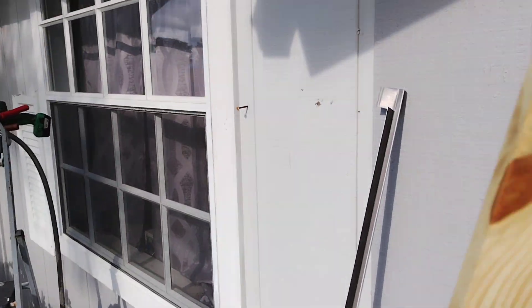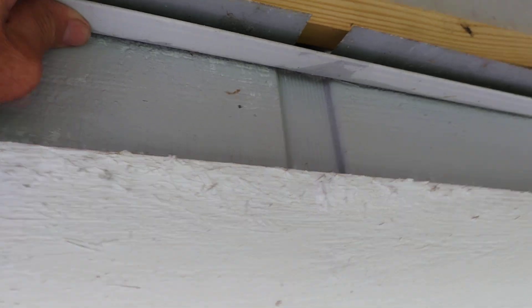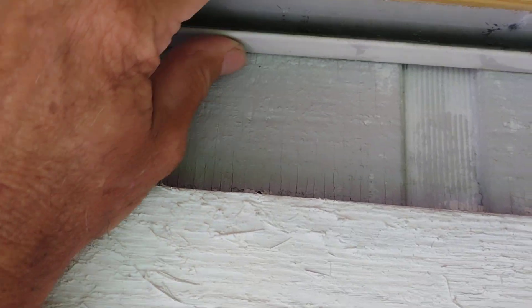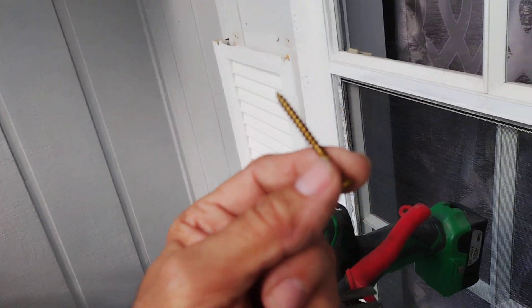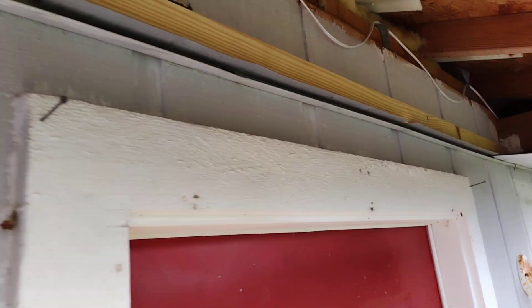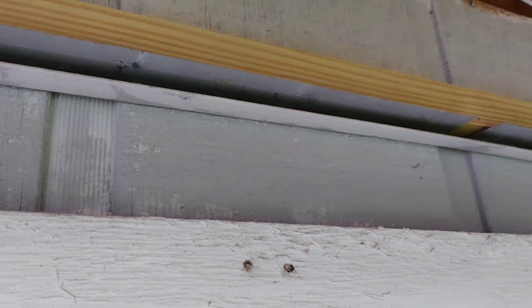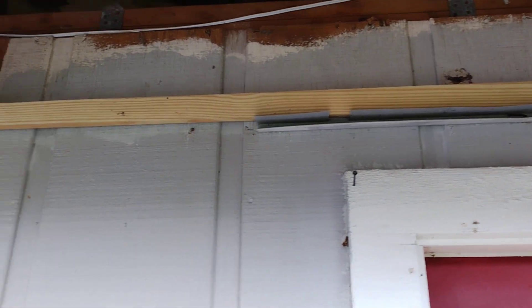That's going to be perfect. What I do is I take a piece of pressure-treated one-by-two and lay that across the top of that J channel. I'll put a deck screw through that, through the J channel and into the frame of the house. That'll sandwich it in there and hold it very securely. When that's screwed on there, there's no way that J channel is ever going to blow up in or out. That'll greatly improve your soffit security.